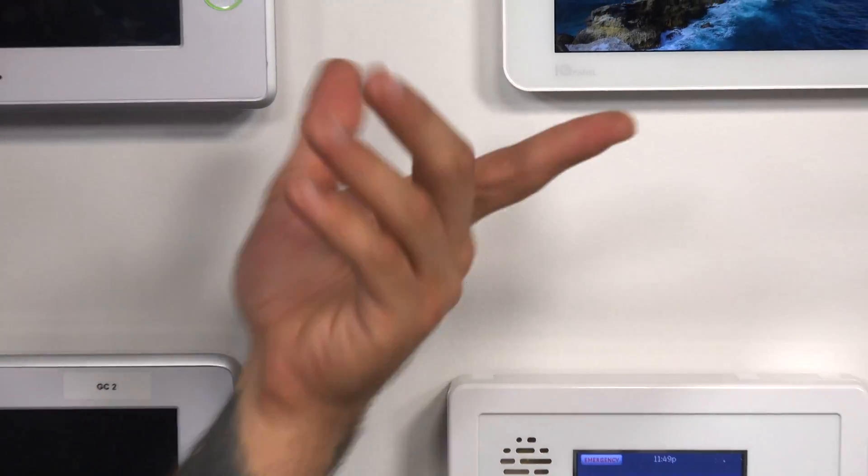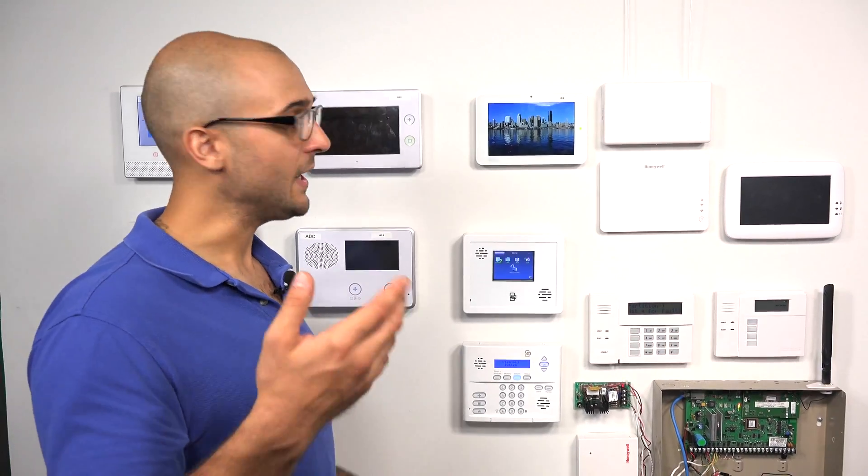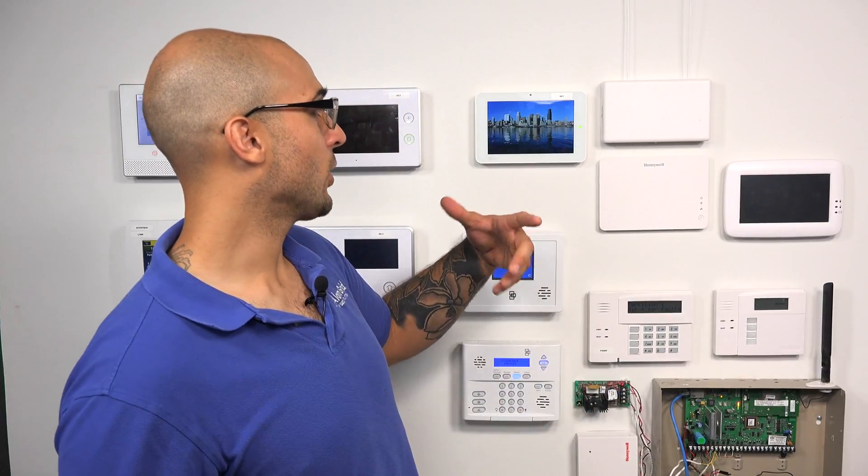What you can do to make them compatible with your IQ2 — if you already have an IQ2 mounted in your house — there's a translator called the IQ Translator 345. What that's going to allow you to do is convert signals that are on the 345 frequency to the 319.5 frequency, which will then let them work with your Qolsys system. Why would you want to do something like this? Let's say you're in a house installing a new system, and there's a whole bunch of Honeywell sensors like the 5816 installed. Instead of spending all the money to replace every sensor in the house, you can simply get the translator module, and that'll convert all the existing sensors to work with your Qolsys system. It's going to make a takeover much, much easier.